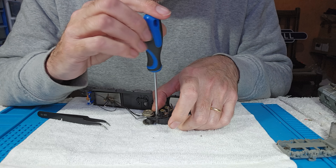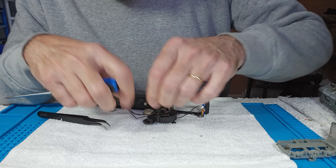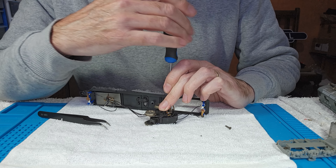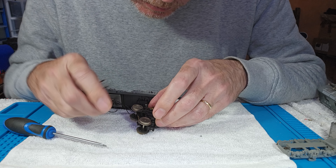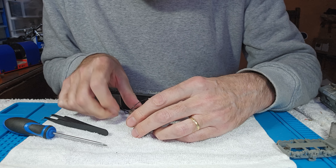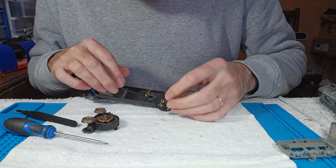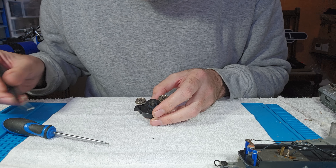We'll see what state the commutator's in, but I think this is probably just a bit dry — it's been in storage for a long time, not been run. David did say it didn't run at all when he tried it, but once it's had a shoogle in the post and I stuck it on the track, it just went. This pickup's kind of stuck onto the plastic casing of the motor. The armature's a bit stuck in there and that should now pull out. So yeah, nothing too untoward — a wee bit of fluffage, a wee bit of grease to clean up, nothing drastic. Pickup's fairly clean, it's all fine. A piece of polystyrene stuck in the mechanism — that won't help things.